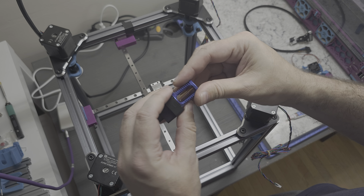I'm going to be using a modified Sherpa Micro. This version does not have a removable idler — the idler is fixed, as you can see here. It has a provision for attaching a micro switch, which can be used as a filament runout sensor. The micro switch faces inside toward where the filament is, and when the switch becomes disengaged, that tells the printer the filament has run out, so it can pause the print. It also has an ECAS 04 connector on top for securing the Bowden tube that runs filament up to the filament spool. That'll attach to the front of the plate.